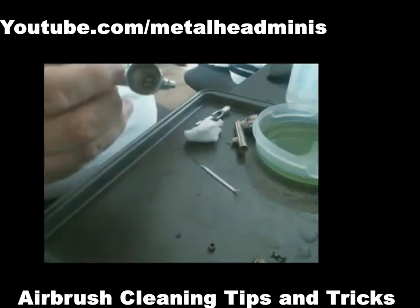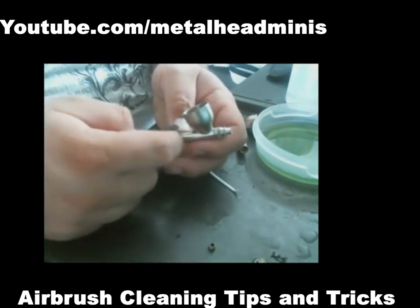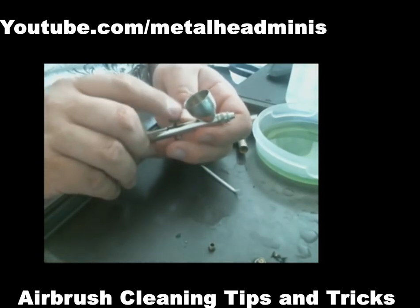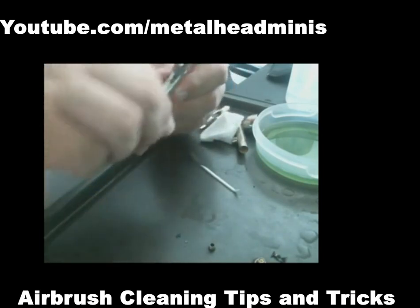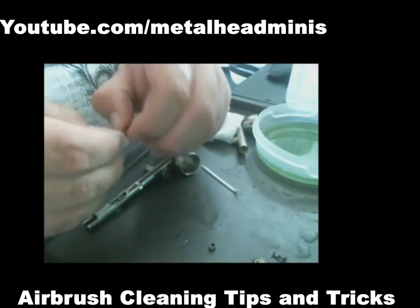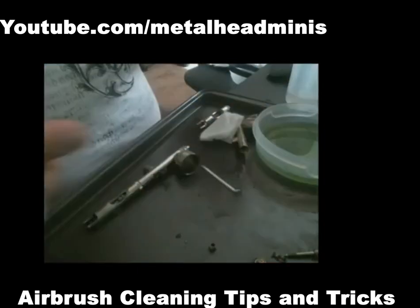Places that you're going to want to put the needle juice and everything to make sure that it stays lubed: put some down in the cup so it can feed back into here and coat the needle. You're going to want to put some here in the trigger assembly just to make sure that this stays nice and smooth. Try to get some on that air pressure controller so it can get down into the spring in the side. The channels in here where the part of the trigger goes, like this, you're going to want to make sure that it goes in there just to make sure that this action right here stays nice and smooth. But other than that, that's really it.